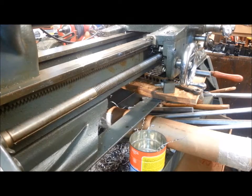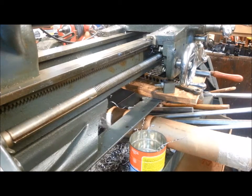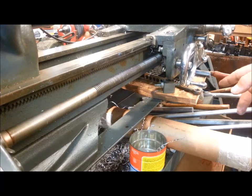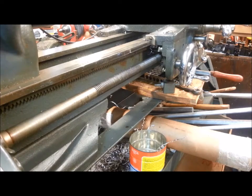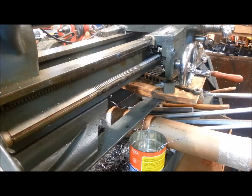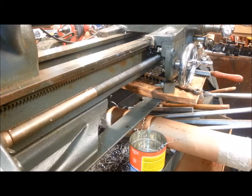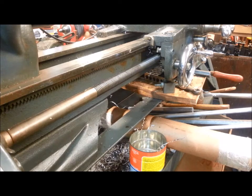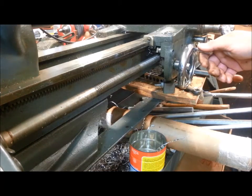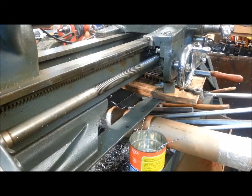Here's an example of our new 0.0021 inches per revolution feed rate. It's like it's barely moving — it's like it's not moving at all. That's pretty awesome. I didn't spend very much time thinking about this. I'm sure you could add another stack of gears and cut this in half again, and then we'd be down to a thousandth of an inch per revolution. But I think this is going to be quite satisfactory. I look forward to testing this out. I'll put a little note on my gearbox to double the number, just so I can remember it.